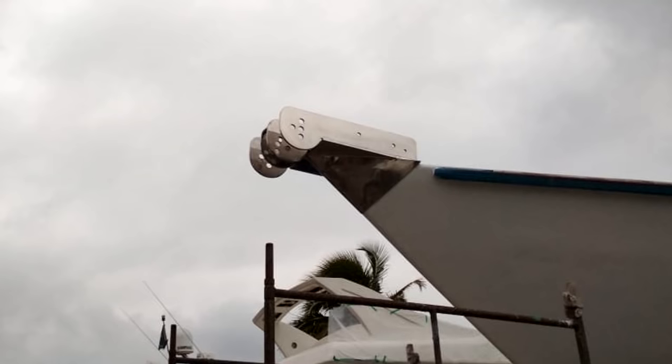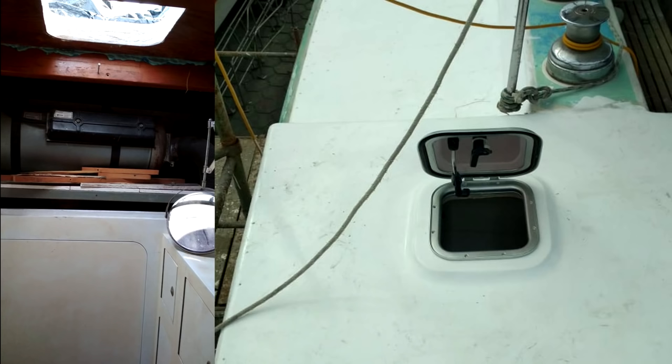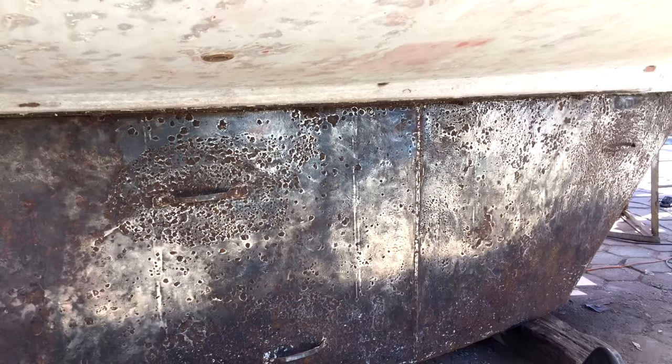We now have good space for two anchors. We installed two hatches in the two toilets, we made a deadwood to the keel, and after we wrapped it with fiber epoxy to protect everything. So now it's completely sealed.